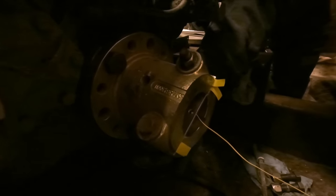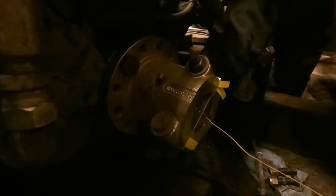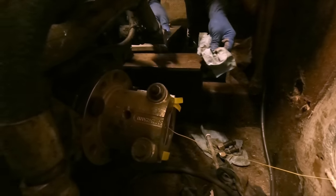as you bring in your coupling right here. So there are two things you want to look for. One is that the gap between them is consistent. You don't want that any more than 3 thou. And then also sag, and that's the distance between this right here. If you had a coupling without pilot bearings, you would have to be very, very concerned about this. If that's off and not locked in, and these two couplings aren't concentric to each other, then you're going to get an oscillating effect with this, and that is a very, very bad thing to have.